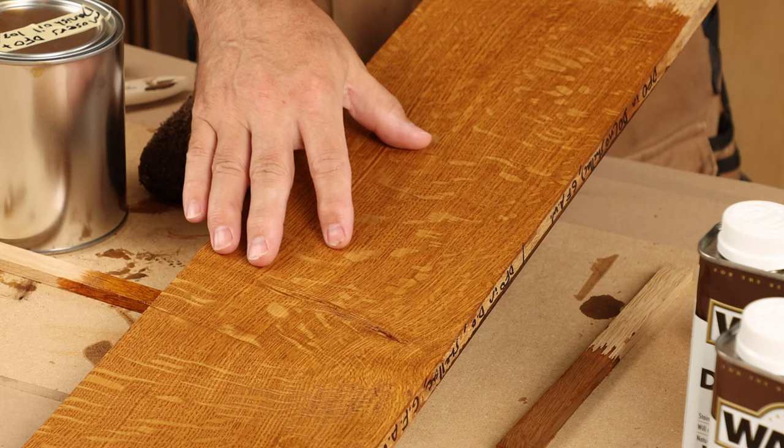There are my results — mixing dye into Danish oil as opposed to the more traditional approaches of water or solvent. Overall, I think the approach looks very favorable and it's something I want to try more of in the shop. One thing to consider is whether you can get the finish dark enough with this approach; it does seem that the color won't be quite as dark as the other methods. But one thing I like about Danish oil in general is just how easy it is to work, and that remained true when I added dye. I wasn't fighting the clock at all and had no trouble with lap marks or witness marks — and that was the main problem I was trying to solve. Do some experimenting and see if this approach is right for your next projects. Remember to give me a thumbs up if you like this topic, subscribe to the Thoughtful Woodworker channel, and we'll see you on the next one.